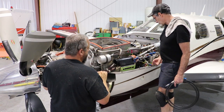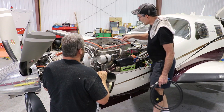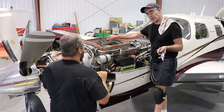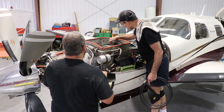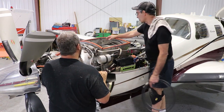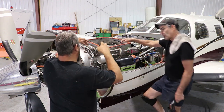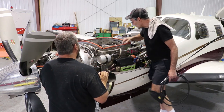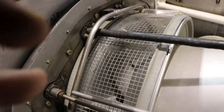The attach point is right here on the airplane and it rides around with the airplane. It's going to go through to the ring. We'll put a little bit of water in there, pressurize our container, and make sure that everything is free and the outlet holes aren't clogged up. Then we'll shut it off, mix up our Turco, and do that. We should be getting even pressure all the way around. If you look up in here — grab the camera so people can see — just inside the engine you can see that wash ring.